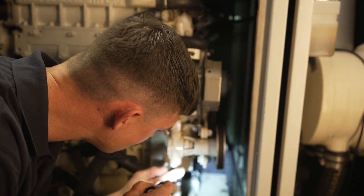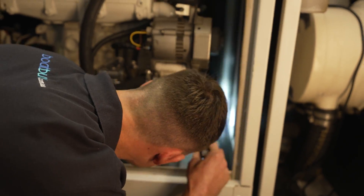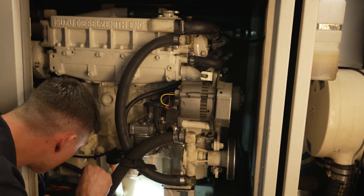Stripping them down, cleaning them and inspecting them for wear. What can happen is if you don't pull these particular components off, you can suffer corrosion or problems with sealing surfaces, gasket failures and things like that, and as a result this can cause internal damage to an engine.